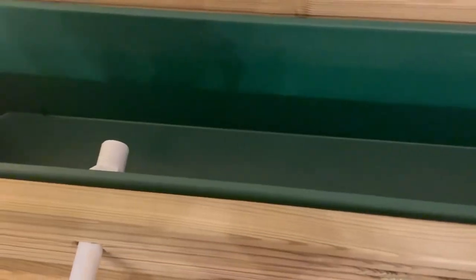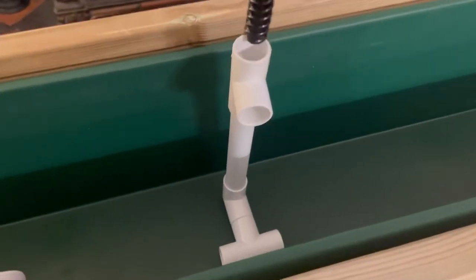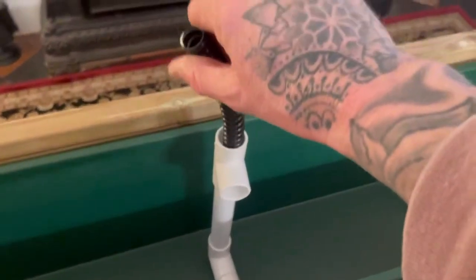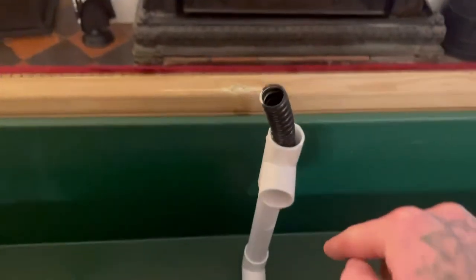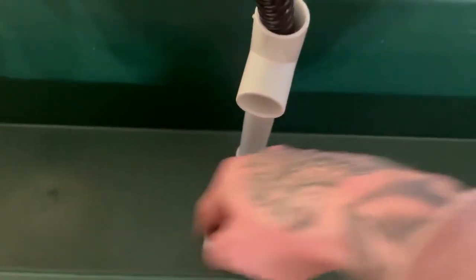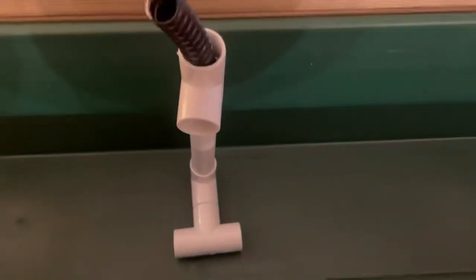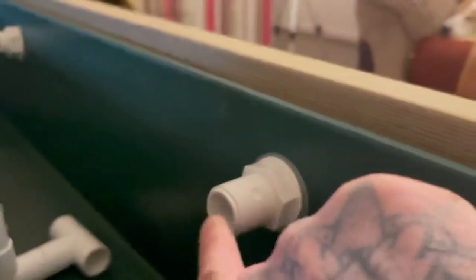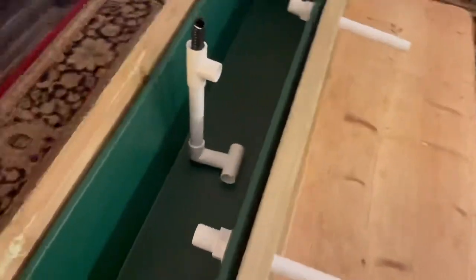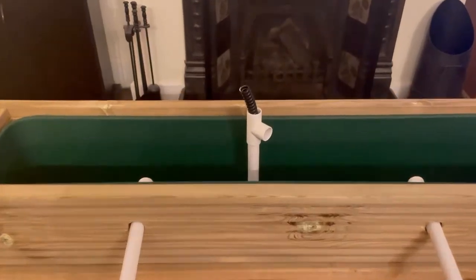What we've got here is a way for the water to be pumped to the bottom of the filter. Gravel will be put on top of it and the water will enter through the top through the pond hosing. The water will be pumped from the pond down the hose and go to the bottom of the filter where it will be dispersed through this T-piece, going either way. It will then rise up through the filter and when it gets to these outlets it will exit back into the pond having been filtered.